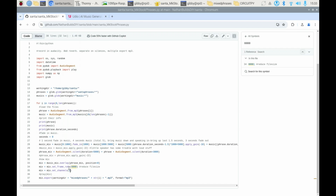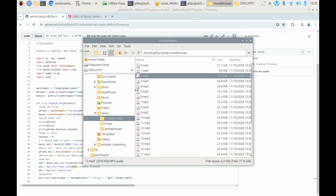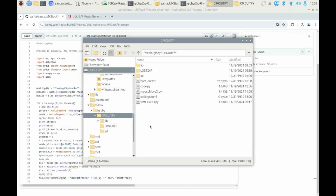And it gets each of these MP3s down into the 20-30 kilobyte range, so that we can fit like 25 or 30 of those into our megabyte of space that we have free out here on the Pico. We actually have 2 megs, but some of it's taken up with CircuitPython stuff. You probably really only got a meg or a meg and a half to work with. So fill it up. Stick it onto your CircuitPython here, fill it up with all of those MP3s.